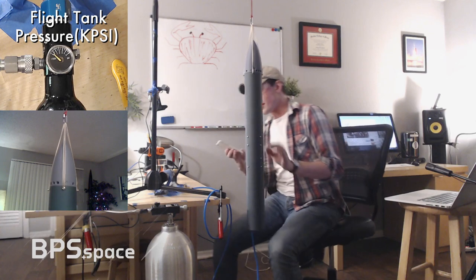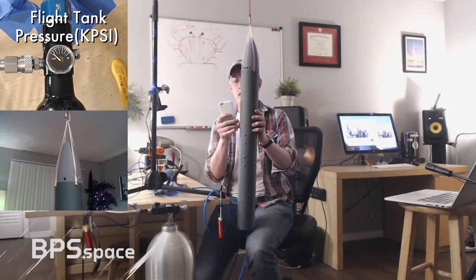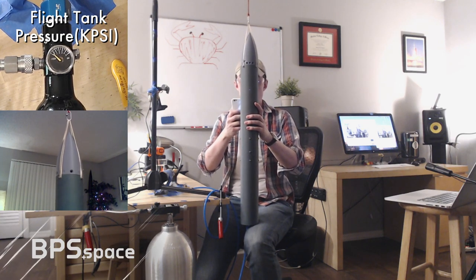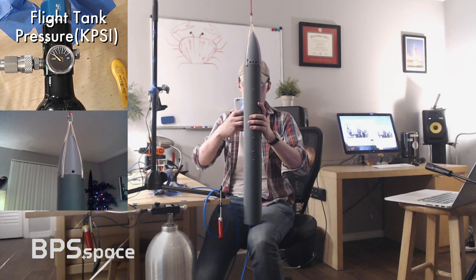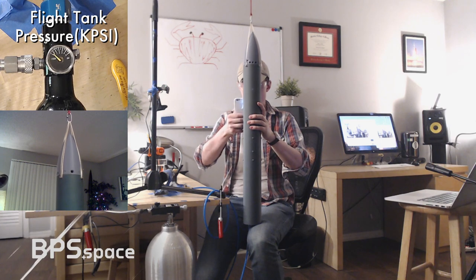Let me go ahead and change the gains on this one more time. I'm going to make them just ever so slightly more sensitive than last time, so it will be fairly aggressive. Still no D gain. It will still be a pure bang-bang controller. So I'm going to bump it up to like 0.07, 0.075. Great.